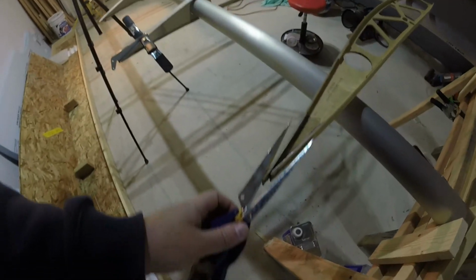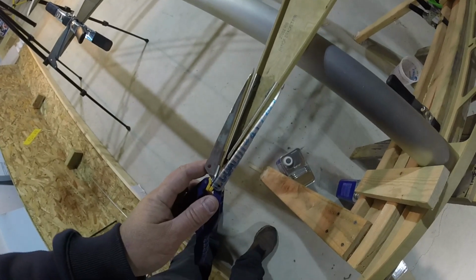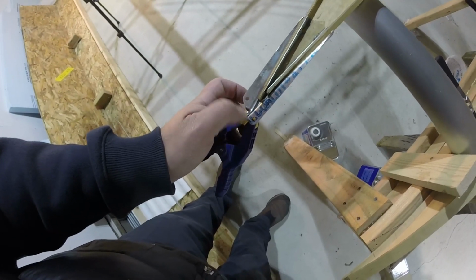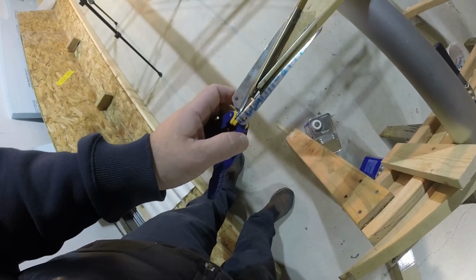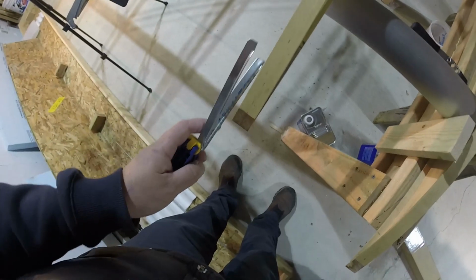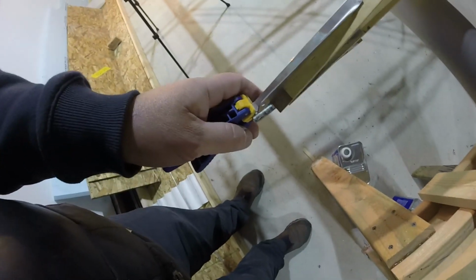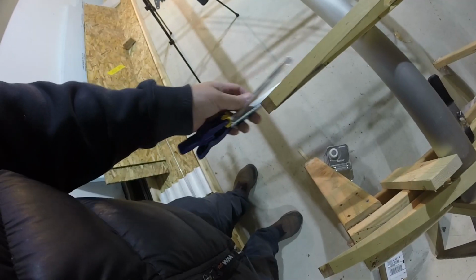And the job is even more difficult than that because when you just clamp the pieces together, you can see the angle doesn't match the airfoil at all. So you have to coordinate, you have to get the angle to fit, keep these flanges down here pretty flat so that they can rivet effectively, and you have to maintain this hole pattern. And this is, again, just one set of brackets. There'd be a mirror image butted up against it if I had them all out here and a couple more hands. I would follow those instructions, but I'm out.